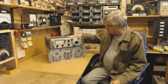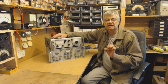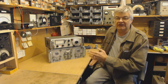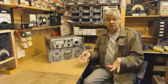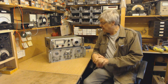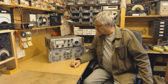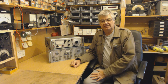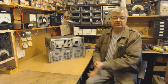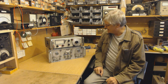So what happens is, first of all you want a nice audio sine wave to put into your amplifier under test. This would normally be used to test either valve or transistor amps - hi-fi type amps for the audiophiles among you. You put a decent sine wave into the amplifier, preferably distortion free - no good if you're putting distortion into the amp before you even start.